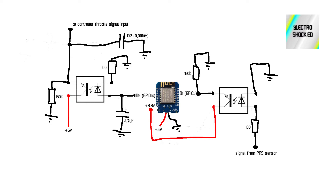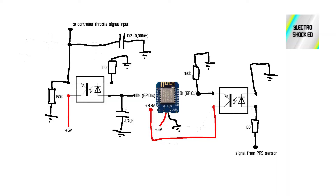The input side is very easy, nothing special here. The output side has two important capacitors to smooth out the PWM output signal and any gaps between signal updates. Don't put any bigger capacitor on the output signal — that will get your throttle stuck. To smooth out voltage even more, you could try replacing that 4.7 capacitor with a bigger one, since this capacitor is not connected to the signal output. I tested a lot of different capacitors, and this is the last working setup that made me very happy.